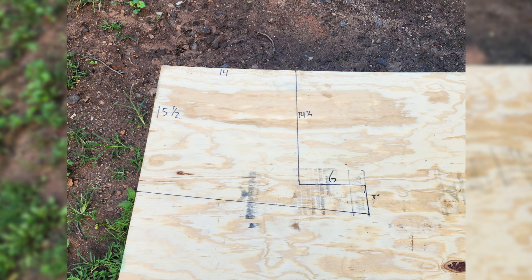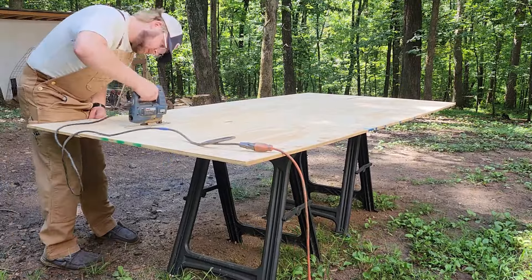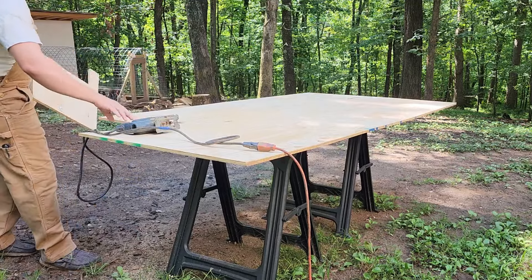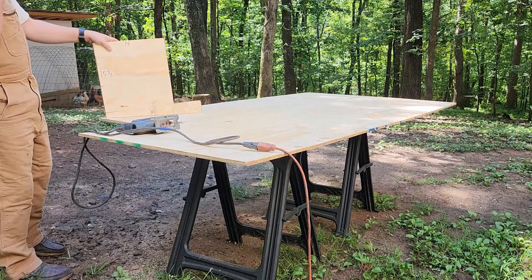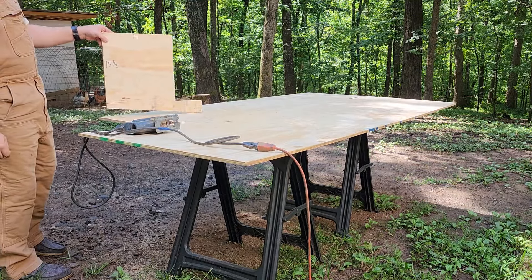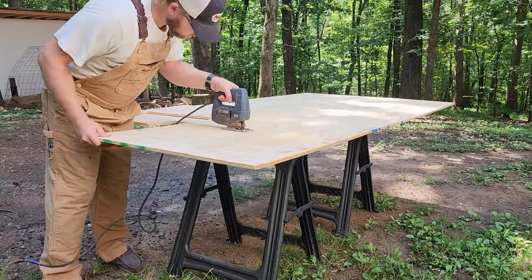Here are the dimensions I used for my project. I would make it just a tad steeper if you're going to be using something like thicker grass as the underlayment, but other than that this ended up being perfect. I'm just using normal plywood. You could make these a little bit shorter with fewer spaces and use only one sheet of four by eight plywood and it would be just fine. I used a jigsaw to cut out all of my slats — these will be standing up and down — and then you just put a sheet of plywood underneath, as you'll see as I move forward.